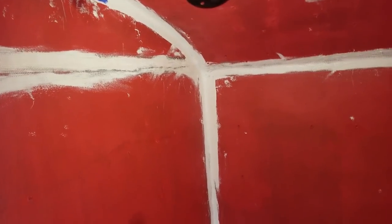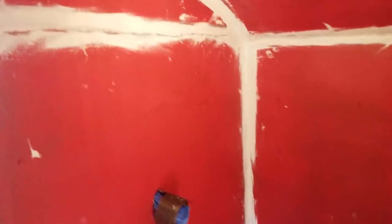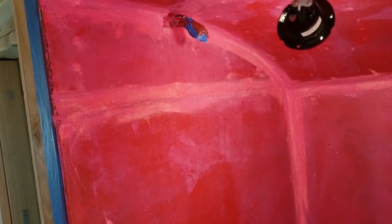It's been about five or six days since I put the construction filler adhesive into the cracks. The mesh is kind of absorbed into it — I pushed it in — and now it's time for the second coat of red guard. The second coat is in. There's a little bit of sealant you can see through the one layer over it. I'll probably do one more coat over all the edges and then it'll be ready for tile.